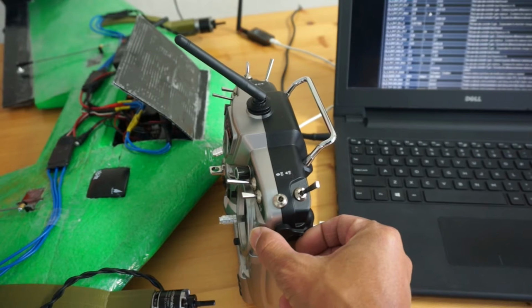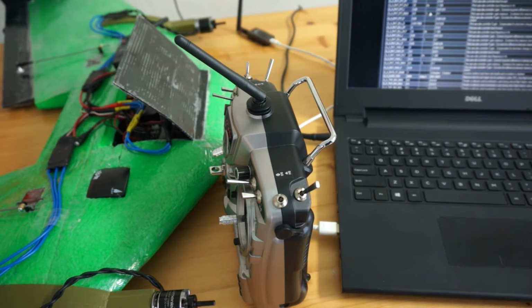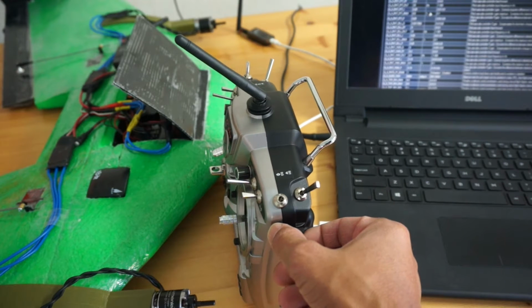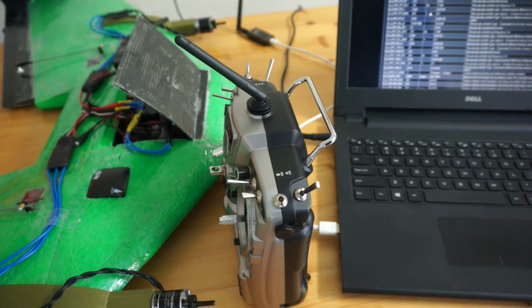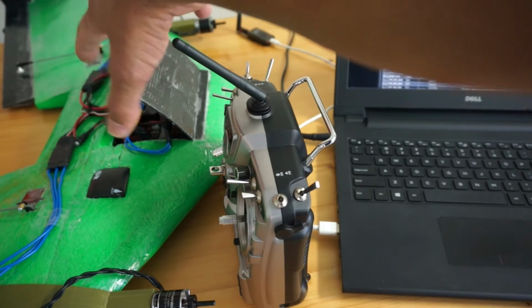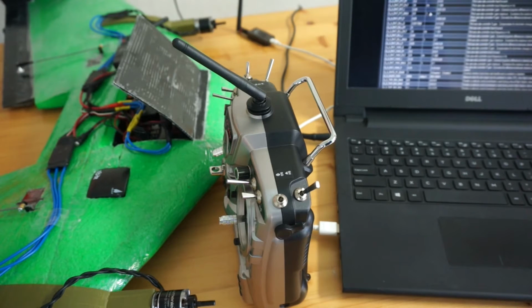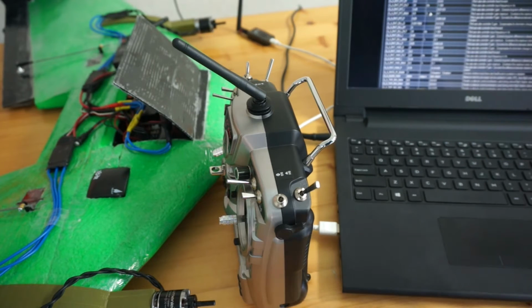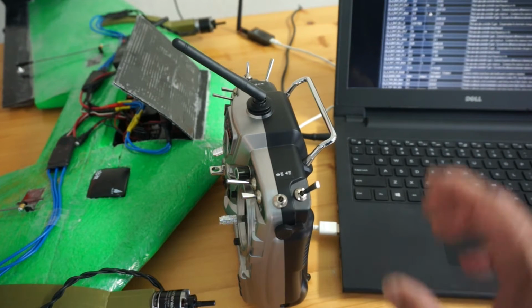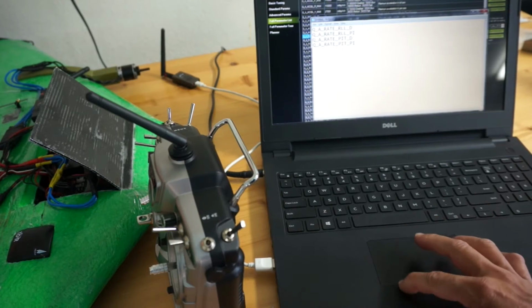Now, when you get started in tuning, it's not actually going to take that value because it could be way too high of a value. So as I go back to midpoint, you could hear the Pixhawk buzzer beep as well as Mission Planner telling us what parameter we're tuning. As you guys know, this does text to speech, but it's very difficult to understand. That's why I have those values written out, just as I know as I toggle my switch, I'm going through each. We know that the tuning has begun.